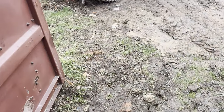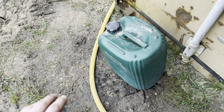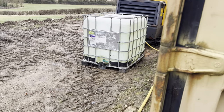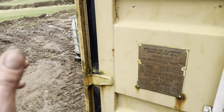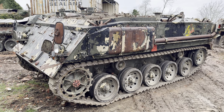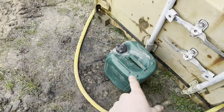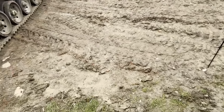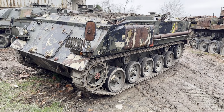So obviously the other thing you'll be wondering is, if you're spraying water on it, it's going to go rusty straight away. Well, you put this additive in, and I'm afraid the label fell off, but you get that from Applied's website. I use 1,000 litres of water, just run off an IBC, and I put about half a can in that. 1,000 litres of water will do a whole day's worth of blasting easily, if not a bit more. And you can leave what you've blasted up to 5 days without putting primer on with that stuff. That is apparently environmentally safe, so if it does go into the water courses, it isn't going to kill anything. So that's a special additive to stop it flash rusting.